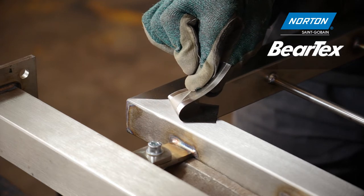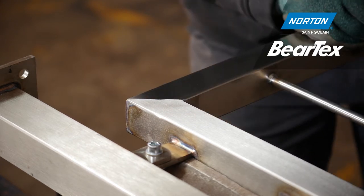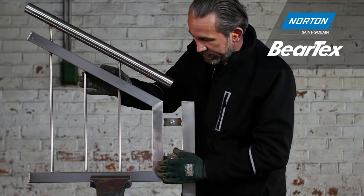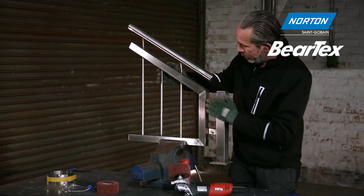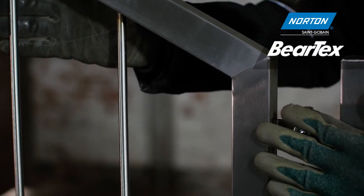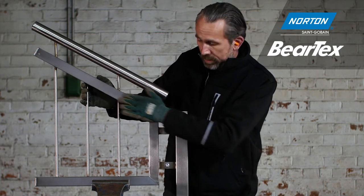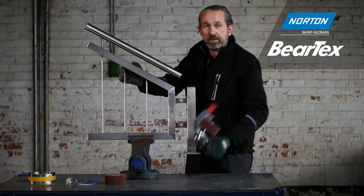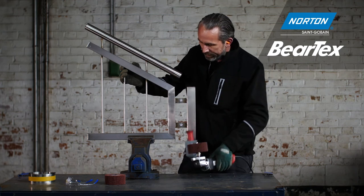Now we can remove the tape. Clearly you can see the two directional lines defined by what we call a mitered joint. Here we have the finished product — the linear finish in this direction, this direction, and this direction. Most importantly, where we used the metal tape to mask off one direction of lines from the other, you've got a very defined line separating them. This satinx process is a really easy, really fast way of finishing, and it's a superb finish.